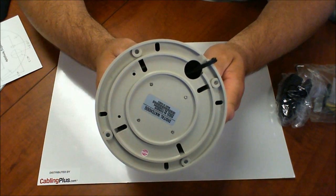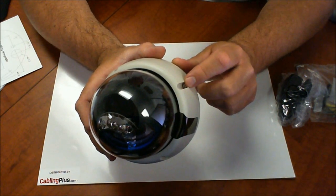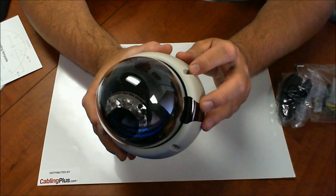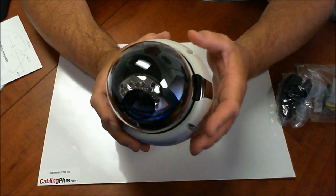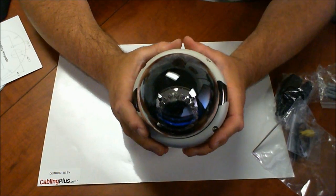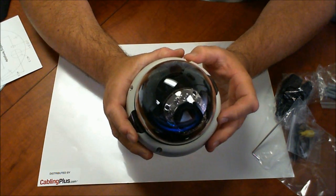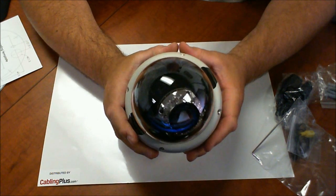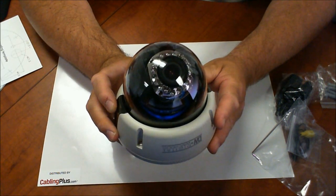Here's the back of the camera. The base is put on via security screws, which means you can't use a basic screwdriver to open this camera up, so it's secure. All the internal guts of the camera are secure. The only way you can pop that is if you have the special security tool they provide. Once you pop this off, you're going to have a nice little joystick menu where you can make all the changes to your video and color — you get full control. Once you've adjusted the camera to support your needs, pop the lid back on, secure it with the screws, and you're ready to go.